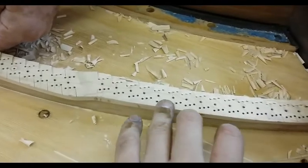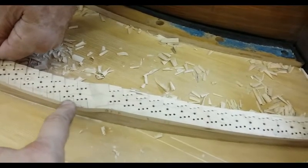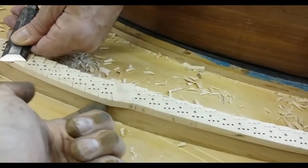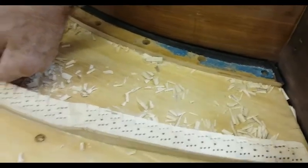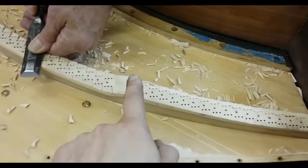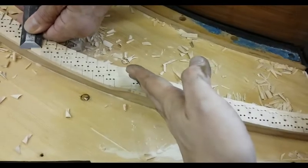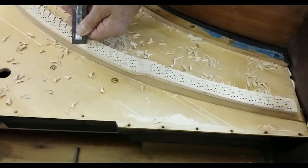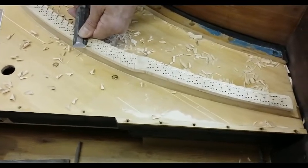So what we've done is calculated it so that these come down a little bit further, and then these are up higher than they were before, before coming down. And this is now staggered, as you can see. It's got a tiny bit of a lip on it that's going to be shanked a little bit so that we can get in the new and improved scaling. On most pianos nowadays you actually see that where it is staggered like that — where the bridge comes down, there's a gap, it'll come out a little bit and then continue going down. But this one, being a slightly earlier model, didn't have that.